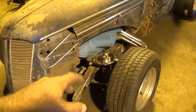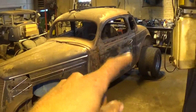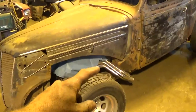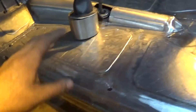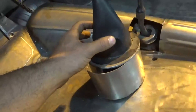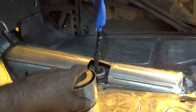It's an independent coilover setup front and back, big rake on this one. It's not going to get painted — it's going to be a rat. Has rear fenders that we're going to cut out for the big tires, but there were no front fenders with the car so we're going to run it fenderless. Going to end up doing some side pipes and stainless down the side off these fender well headers, but that's all in the future. For today I'll show you how far I got in here — firewall done, clutch and brake pedal put in, still need a throttle pedal. Most of this stuff is in the works, welded up and ground. Floor pans, shifter tower here, some parts cut nice — my boot, my ring and stuff — probably going to start off with that today and get that fabbed into the floor.